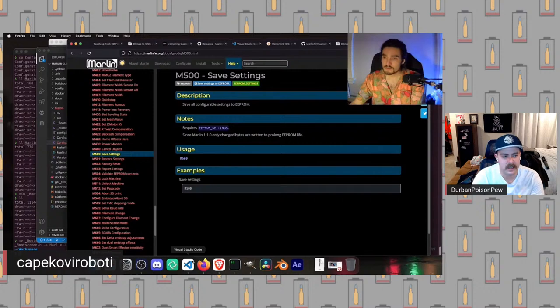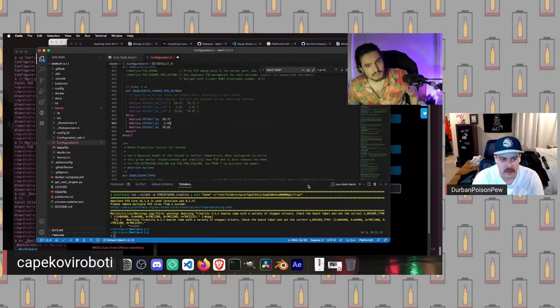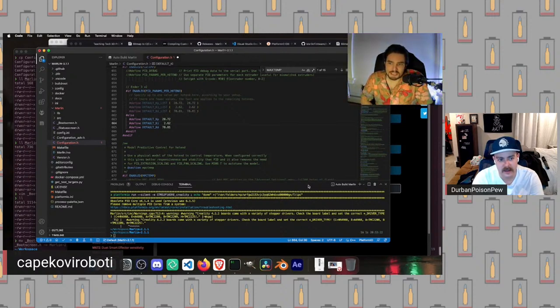Okay. Is there a point when, because I think its default cycle is 5, there's like default cycles of 5 or something like that, is there a point when adding cycles is no longer beneficial? So I think the answer is it depends. Adding 120 cycles, way overkill, you don't need to do that. But it may be the case that you're seeing a more accurate tune at 8 cycles than 5. And so it may be worth it to you, since you don't PID tune super often, to just add a few extra cycles in there. My default number, which may or may not be just habit, is 8. I don't know why I decided to do 8 in the past, but I always just do 8 when I'm tuning PID.